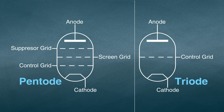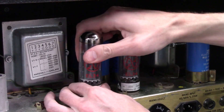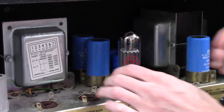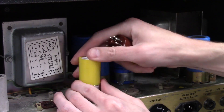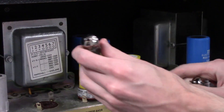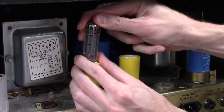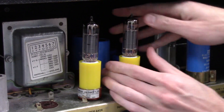It is also available in a triode version which provides greater power reduction and more linearity. To install the YJS, simply remove the power tubes and insert the YJS. Make sure the tubes and the Yellowjacket converter are both cool before handling them. Next, insert the EL84 into the top of the YJS. The YJS uses a standard 9 pin socket on top so you can try various EL84s to see how they sound.